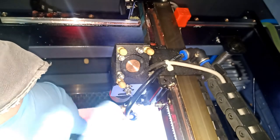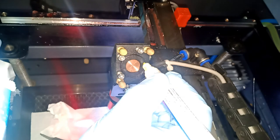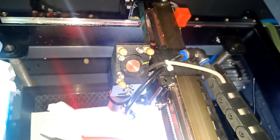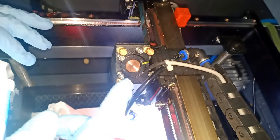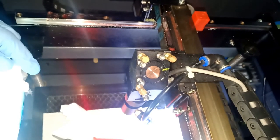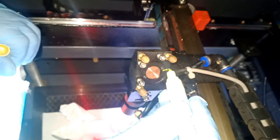A little trick I do use for sometimes tying stuff like that, just in case, if you really want to see if this guy is moving or something, you could put a small line of paint, something like this, just in the future. If something went off alignment, you want to see, so you can see even on the gears, you know, do the same thing. Just in case you want to see something is moving or something going crazy, it's a good idea to mark the stuff, okay?